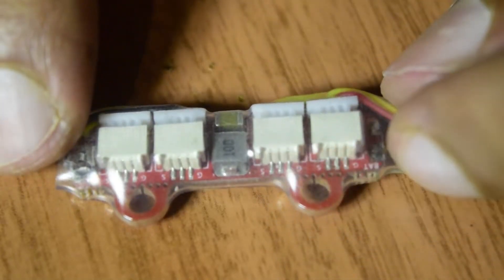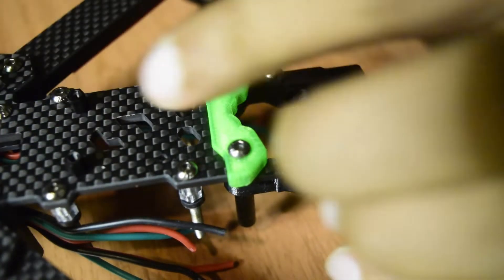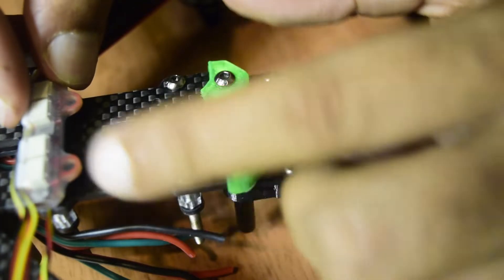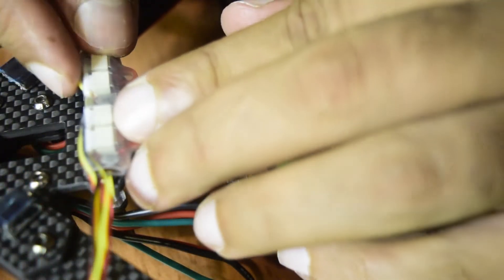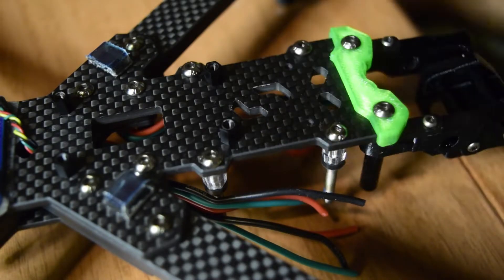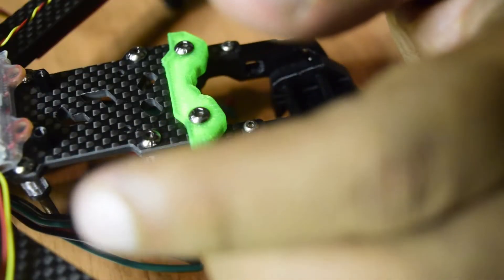Now let's install this driver onto my drone frame. There are two risers on my drone frame - plastic risers with M.2 screws which are properly aligning with my LED driver. I am going to install my LED driver on these risers. This is the back side of the drone frame. From here I am going to connect the jumper wires onto the LED strips and install them on the arm. The signal wire is going through this center hole onto the front to connect to my flight controller.